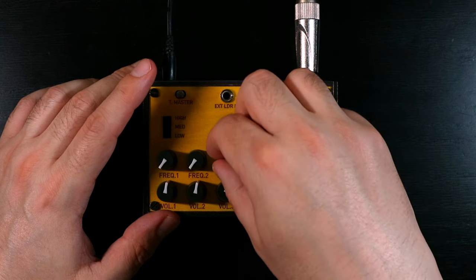The other knob that we have here is a gain control. This is gain going into the filter. And this starts to kind of speak to what I think this mix is really for. Because like the internals of the Lumanoise V4, this mixer is very happy to be overdriven. And as you start to overdrive things into the filter, you, A, get interesting burbly resonances, but also, as you can start to hear now, quite a lot of crunch.